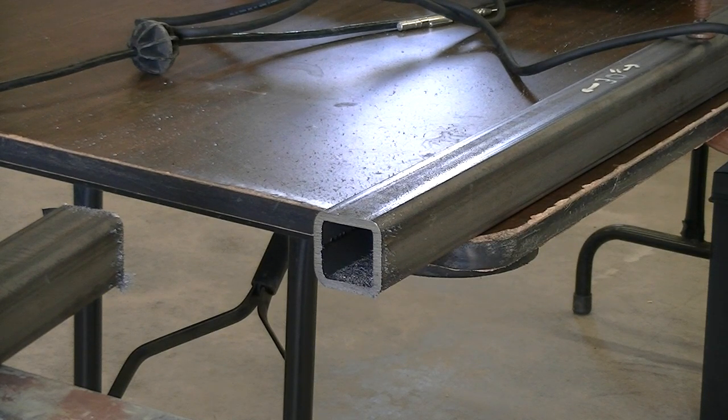When you start pushing down, trying to get into too much of a hurry, that's when you also start to make a taper. Once I get to the bottom part of the cut, I tilt it back slightly so instead of cutting straight across the bottom, it cuts at a bit of an angle across the bottom. It seems to make it a little bit nicer that way. I don't do that on the top, mainly because I'm trying to get that cut straight down as well as I can. That's how I do it.